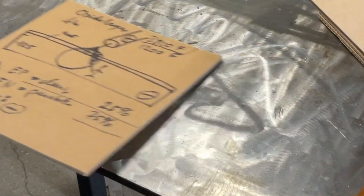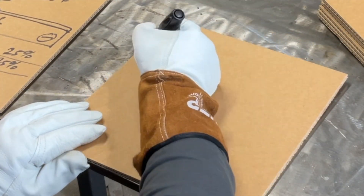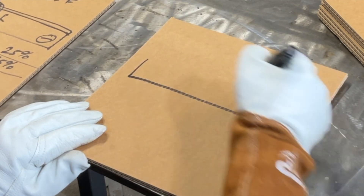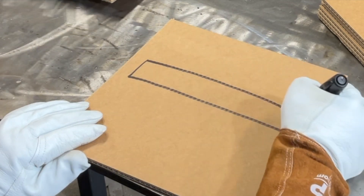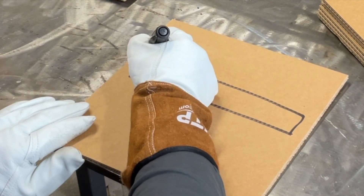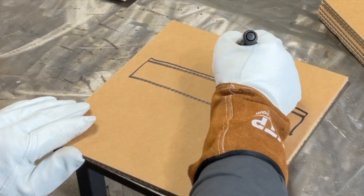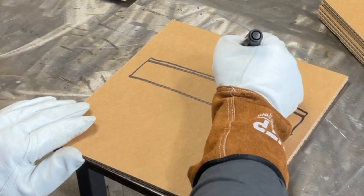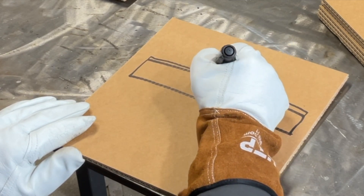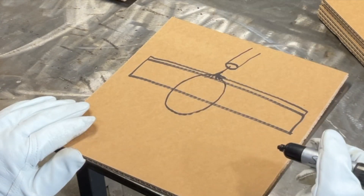Now picture this more dramatically where you have material that is one-sixteenth of an inch. Here's your oxide layer. Here comes your electrode positive MIG. The stream comes down and forms the nugget — and next thing you notice, you have a hole in your material.